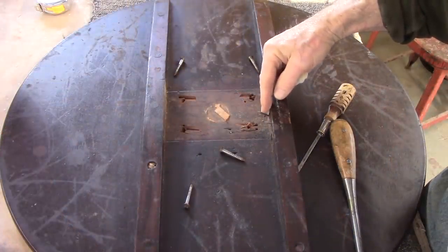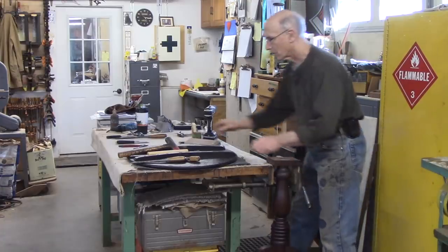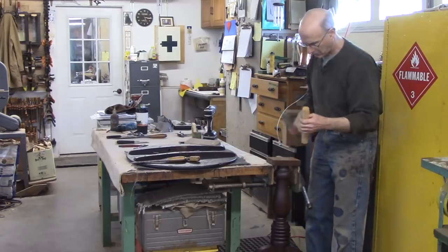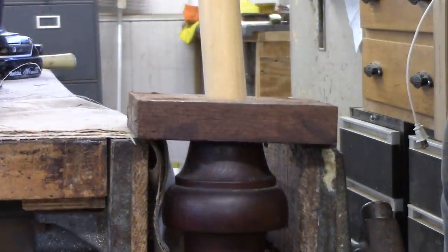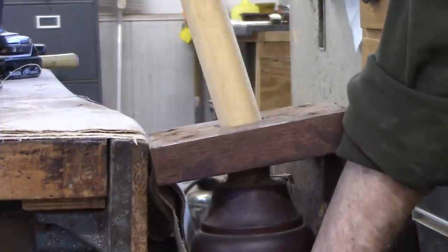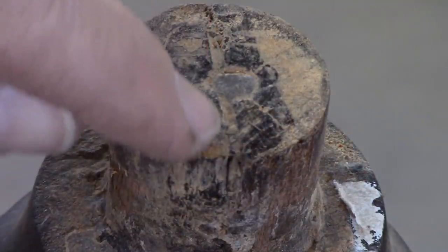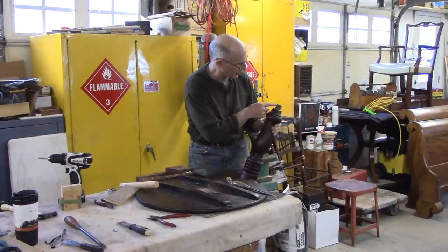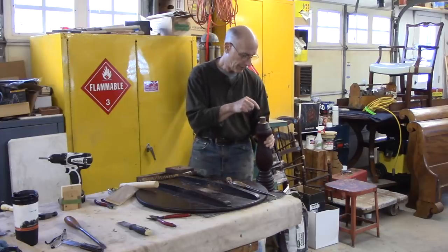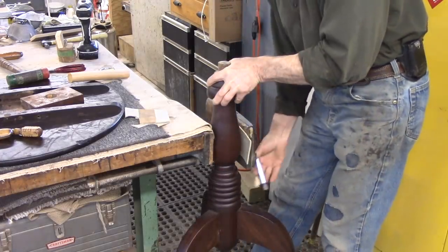Here are those other two nails — they bent out, but boy, what a mess this is. I think I see where there used to be a wedge in here. The wedge might still be there, which is good because I want to reuse that wedge. But I think there's a big nail right in the center of this thing, so instead of trying to pull it out I'm going to start my cut for the wedge with a hacksaw.